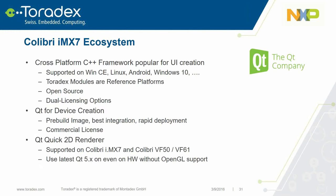The Qt company is a partner — you saw the robot demo using the Qt framework on the IMX7. Qt is a cross-platform C++ framework commonly used for UI creation, supporting Linux, WinCE, Android, Windows 10, and others. Their Qt for Device Creation is an embedded variant supported on Toradex NXP-based Colibri modules. They also have a Qt Quick 2D renderer supporting the Colibri IMX7 and Colibri Vybrid modules, with hardware optimizations for the graphics stack.